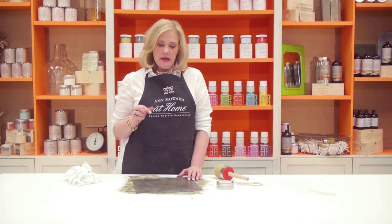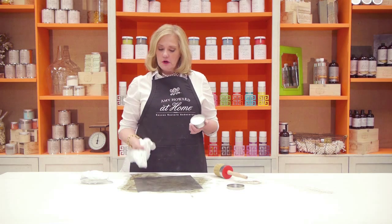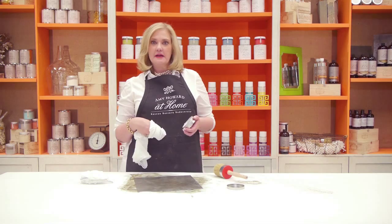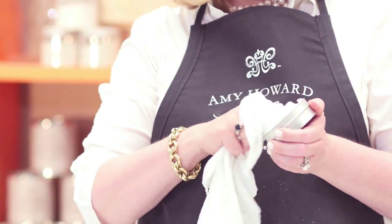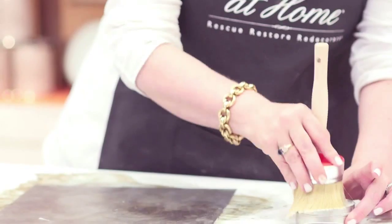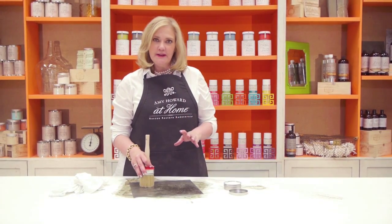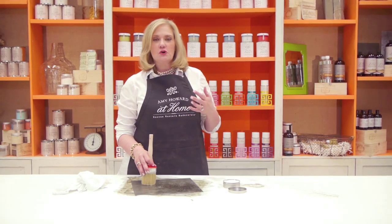After it's dried about 30 minutes to an hour, it's ready for me to apply my wax. I can put clear wax on top of my antique Parisian zinc finish and as it dries, it's going to go back to this beautiful dead chalky finish. The longer you give it to dry, the better it's going to look after you've waxed it — I prefer at least an hour. If you need to leave the project and come back tomorrow, that's absolutely fine. I'm going to take my clear wax, use a generous amount, and apply it with my hog hair brush. It needs to be clear wax because it allows the depth of the color to show — our beauty and texture is already in this zinc, so we're just wanting to protect it for use on a countertop.